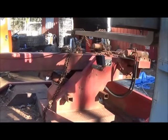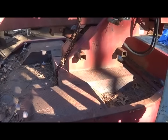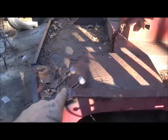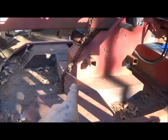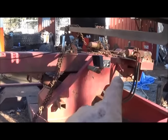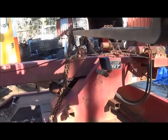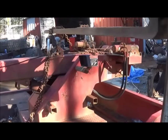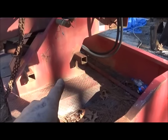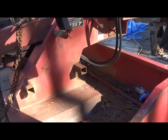We're fixing to try to get this off here. Got all the bolts out from this end underneath, and the rods — the rods just run the control valves that are mounted on the bottom of this and go to the levers. There are rods that run all the way across and short rods that run up to the controls. We've got it chained up — I'm thinking the winch end is probably a little heavier since they've got some pieces welded on it, kind of like lifting eyes. We're going to try to pick it like that and see how it goes. I'll put just a little bit of pressure on and cut these bolts because I can't get to the bottoms to hold them. There should be six of them — there were six in the front.